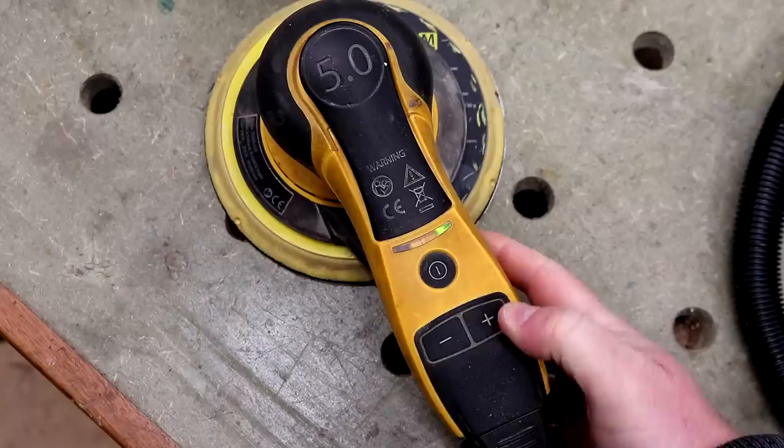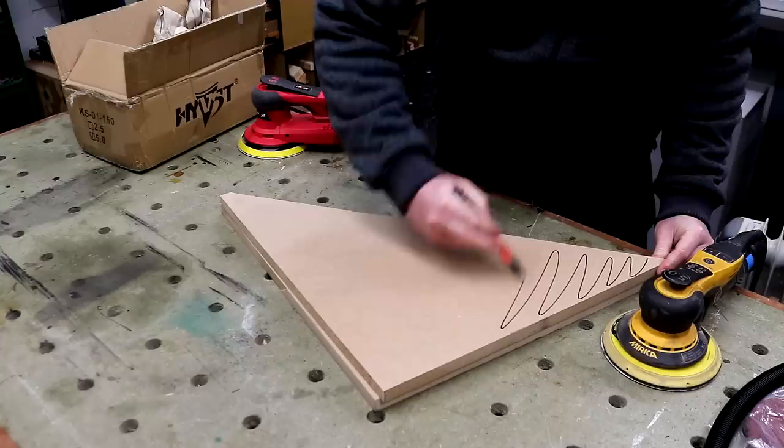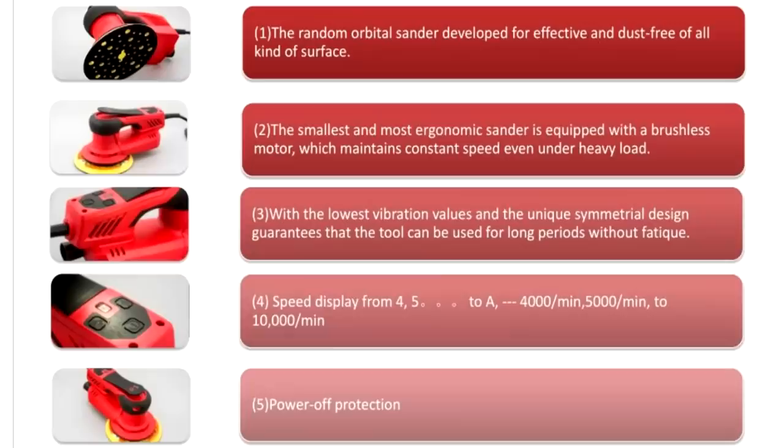So now on to testing. I've come up with a series of categories and tests. The first is speed. Both sanders are set to maximum speed and I've installed a brand new 80 grit disc to each — the same brand of discs — and I'm timing how long it takes to remove marker pen lines from a board. In the speed test, the Hivst performed just as well as the Merker with no noticeable difference in speed at all, which is no great surprise because both machines indicate a maximum RPM of 10,000 per minute.